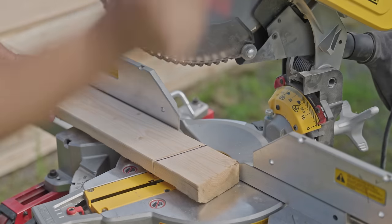Okay. It's as close as you're going to get for now, because my ladder's in the way. There we go. Very important here that we square off this roof right off the very beginning. So what I'm looking for is the bottom of this sheathing is just a hair more than my fascia. Right now I am almost there. I need just a touch. There. I need you to rotate your top corner there because we want to go perfectly flush.